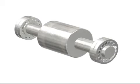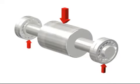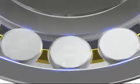Before focusing on the demands of an eccentric rotating shaft, let's take a quick look at the more typical shaft system inside a fan or an impactor. Two bearings support a steady load from the shaft. Standard spherical roller bearings perform well, running cool in this application with a steady inner ring load.